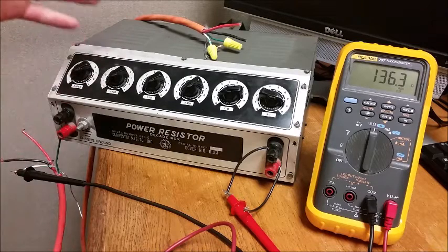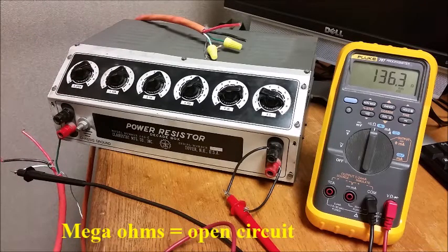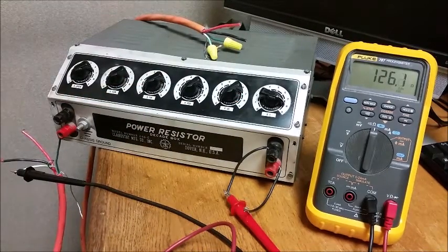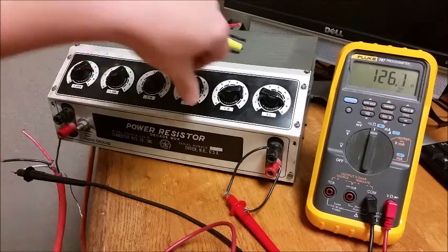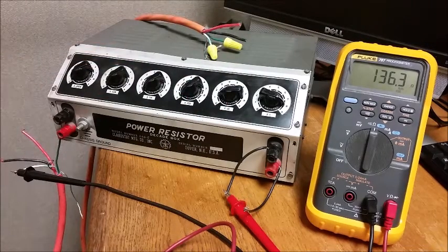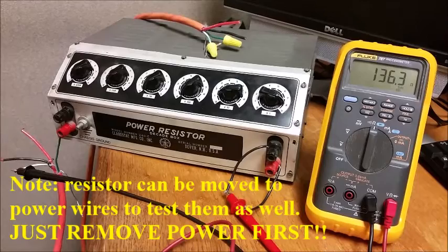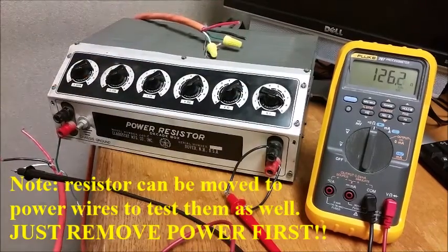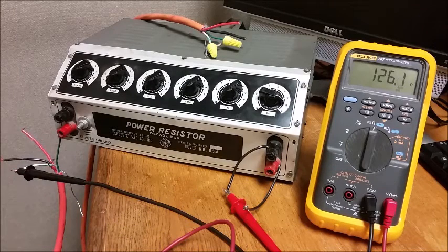Now I could go through and simulate some of the other more obvious ones, but I wanted to point out to you, it doesn't take much to go from that's a good run of cable across those two conductors to looking like it's 2,000 foot or having some corrosion in a butt splice or a connection down that same 1,000 foot of cable. Okay, so again, 1,000 foot, good. Just to recap, this is troubleshooting cable.